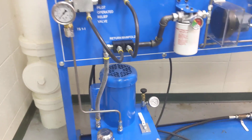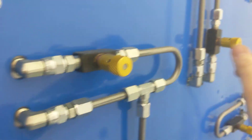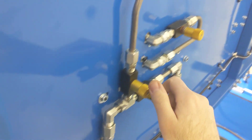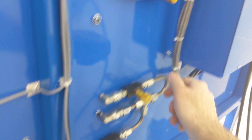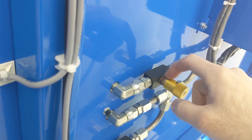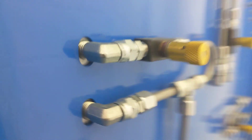There is a setup you need to make sure has no faults. If I go around to the back side, you need to make sure this one is open, this one is open all the way, this one is open all the way, this one is closed, this one is closed — open, open, open, closed. You can tell by this being all the way out. And then this one down here is closed. Make sure that these valves are in this proper setup.